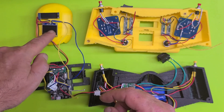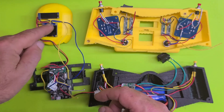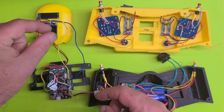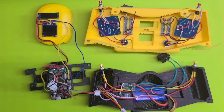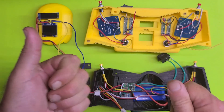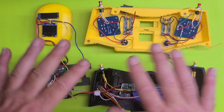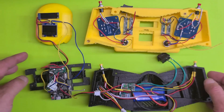In your specific case you may have to do what I had to do — on the back of these OLEDs there's a tiny resistor you actually have to move to a different pad to create a different address. I had to do that and then adjust the code accordingly. Those two things — NRF channel and OLED address — you may have to adjust depending on your circumstance and hardware.